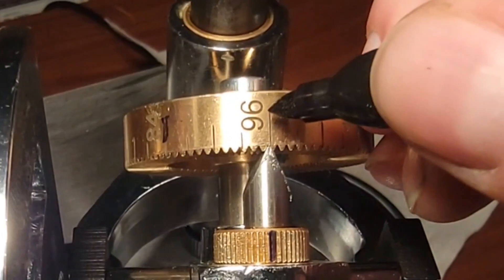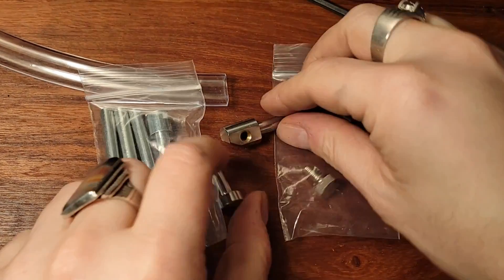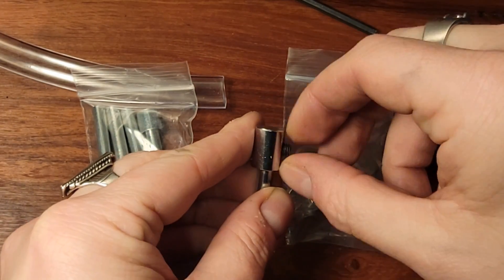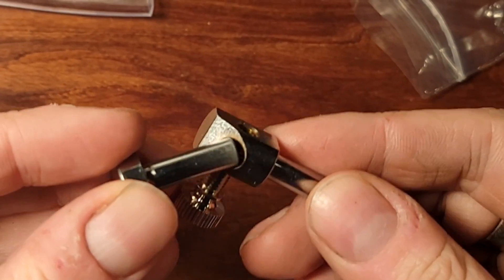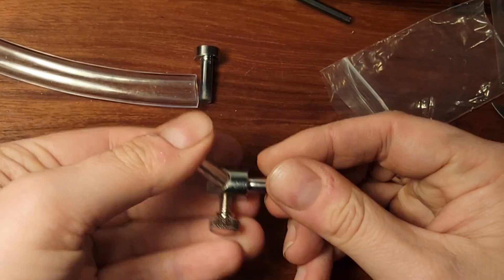While you're looking at the gear, you might also want to mark the major angles a little more boldly with your Sharpie — it can help a bit when you're starting out. Now let's fix the table adapter, which is used for cutting the flat top or table of your gemstone. The first issue is a set screw that requires an allen wrench that isn't even included — just unthread it and substitute the thumb screw from the bolt set. On two of the machines we've handled, the flat reference top didn't even fit into the adapter, but if that happens, we've provided an extra in your kit.